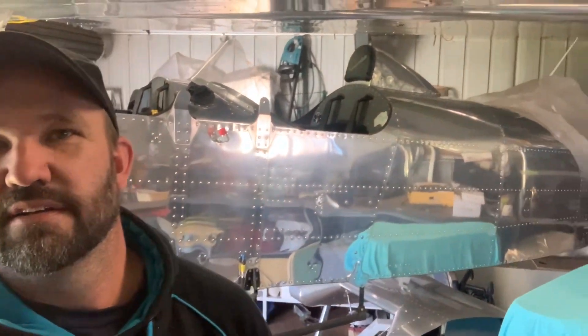Hopefully that gives you a bit more of an overview on the art form of solid rivets. I'm a big fan - I've been doing it for years so I suppose I'm a bit biased, but the end result looks pretty sweet. Just remember the key is communication. The person on the gun and the person on the dolly both need to know the calls: tap, draw, rivet, and any other calls you want to use. As long as they both understand what's going on, it's going to be sweet.